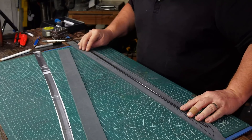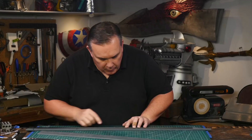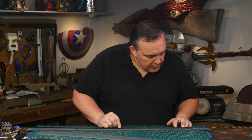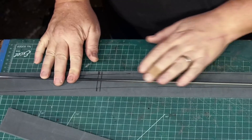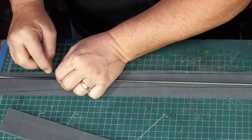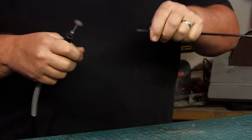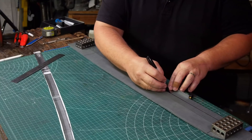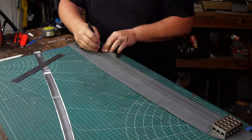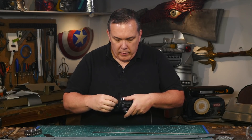I look at how well the rod will fit inside of the blade — that's about what I want, where it gets really close to this edge but not all the way. This isn't going to quite work but that's okay. The rod is the right length and now to make space for it inside of the blade. I mark the center line of my blade blanks and I'm going to cut a channel with a router attachment on my rotary tool.